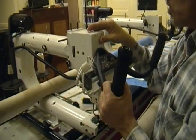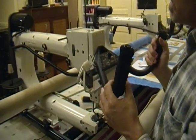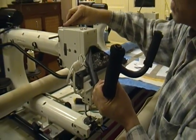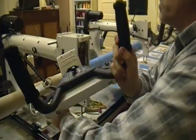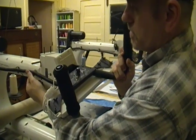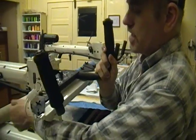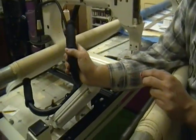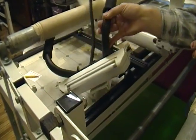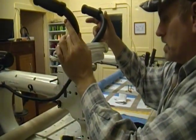Next, make sure that you have your machine locked — carriage and head — so it doesn't move forward or backwards. If you don't have the holder for the top that the face plate will rest upon, make sure you've removed the side wire and wire protector from the clamps, then sit it gently on the table so you don't accidentally knock it off and pull your wires out. We don't have to worry about that; we have the clamps set up. Set that right on top.